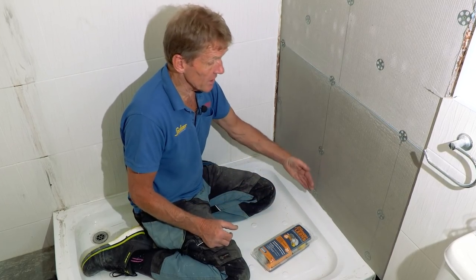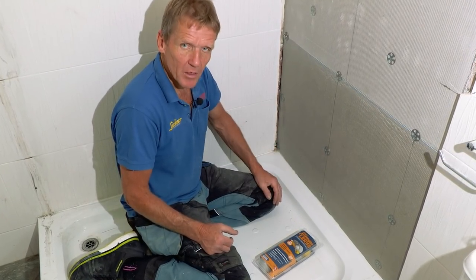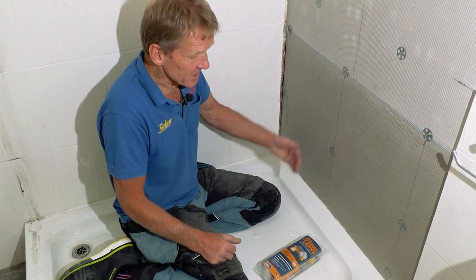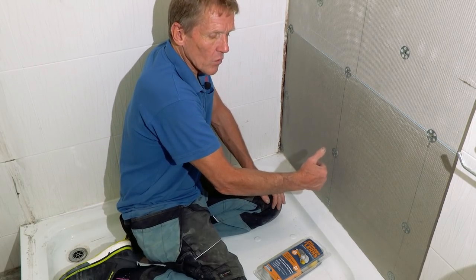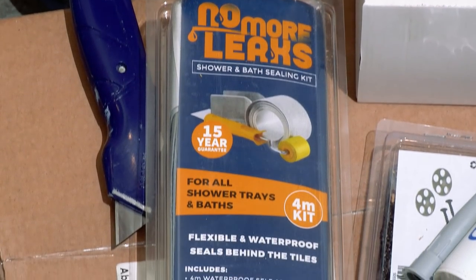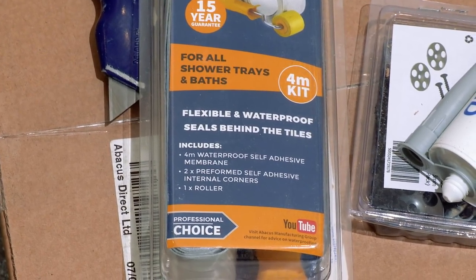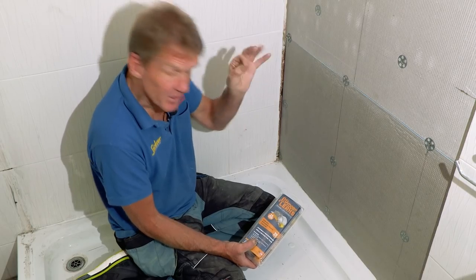Now, some shower trays have a little upstand behind them to prevent leakage, but as you can see, this one didn't work very well, and sometimes they can be a bit of a nuisance because it means you've got to carve out the back of the board or cut the back of the tile out to stop it kicking out on an upstand. So you're better off just getting a plain tray with no upstands and using this kit around the whole perimeter, which is what I'm going to do when I fit the new tray, which will be in the next video.